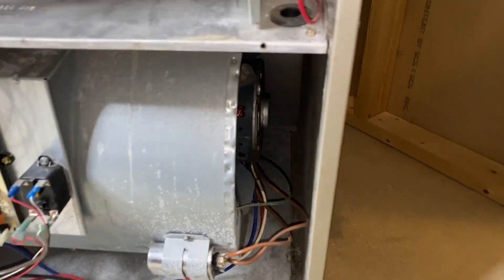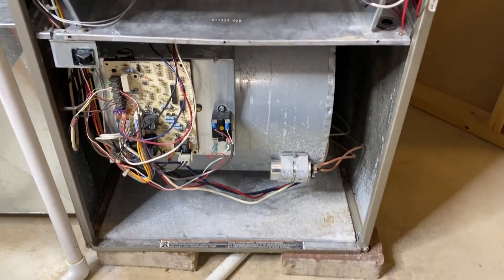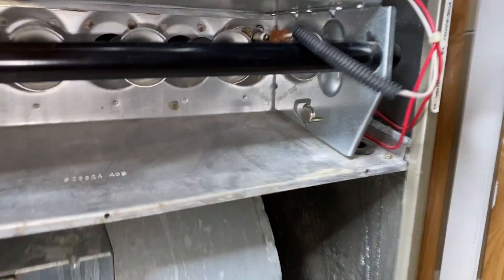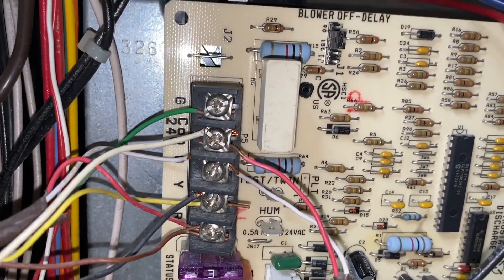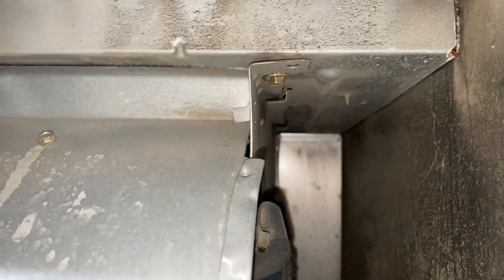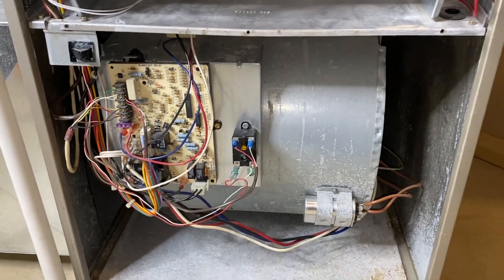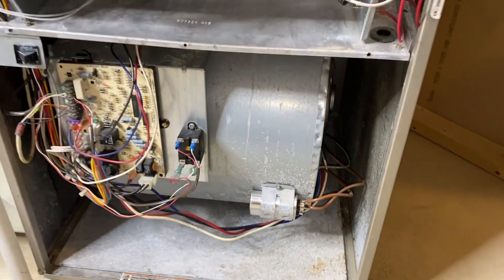How do you clean that? There's no easy way to do this. You basically have to remove this entire housing and pull it out — which can be done; it definitely is a DIY project. Then you need to vacuum up the internal portion of the fan to remove all of that dust buildup and lower the weight of those fan blades. While you're here, there are a lot of wires that feed into Phillips screws and connections — make sure those are tight; do not over-tighten them, but you definitely don't want them loose. You've got screws that secure the mount portion of this unit in place — you'll unscrew those, carefully come to the other side, and maneuver this out without damaging any wiring. You'll also have to remove this screw here to pull this adjustable locking panel down and remove your capacitor, then pull that unit out to clean it.